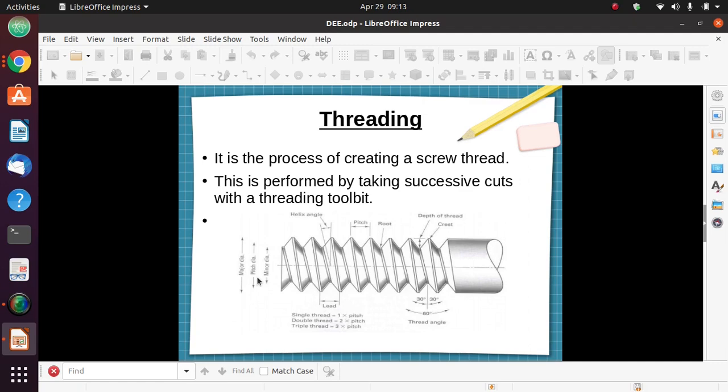When we talk about these things, we're not required to do those calculations, but if you are doing something mechanical wise, ingebidi sasa, you do those calculations. For example, if you are making a project and you have to determine how much you want your screw to move. Kwa mfano, if you are doing something to do with power transmission and you are using threads to move your project, then it will be necessary to understand this major diameter, pitch diameter, and all that.